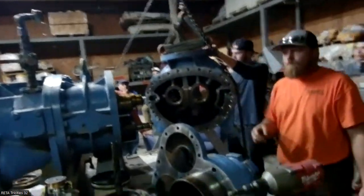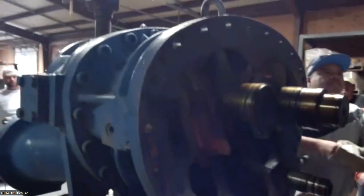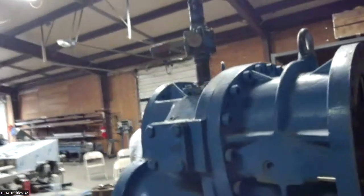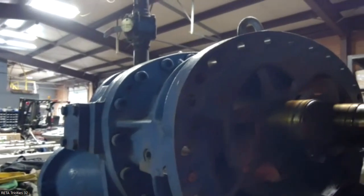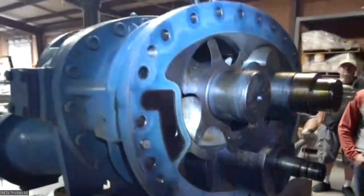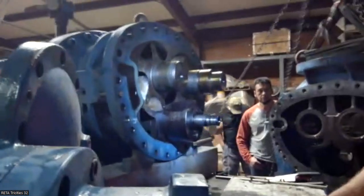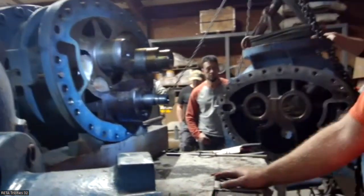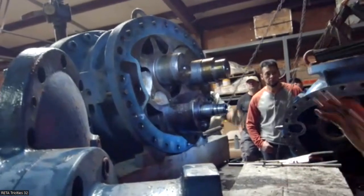During a compressor rebuild, how many of the consumable parts do you actually say passes inspection, I'm going to reinstall it? A lot of times, the tolerance in this is very tight. I replace this. It doesn't matter if it's fine or anything, it's not worth it. You guys are looking for longevity in your machine, and you don't want me to pay attention to something that's barely in tolerance, because then in a year when you have an issue, you're like, this is useless. So that's the thing.